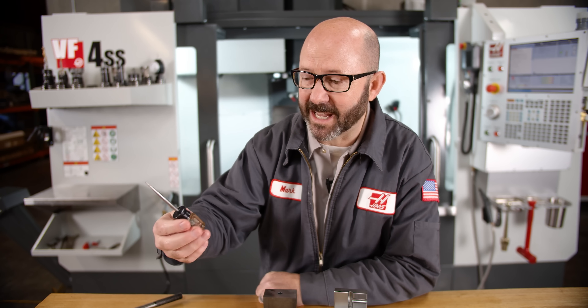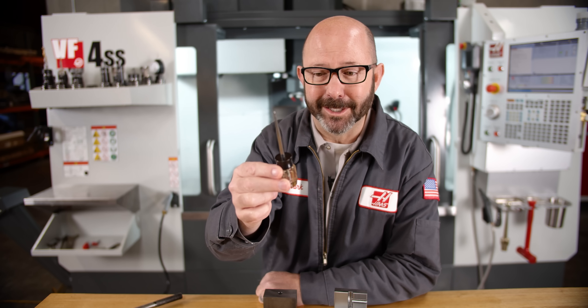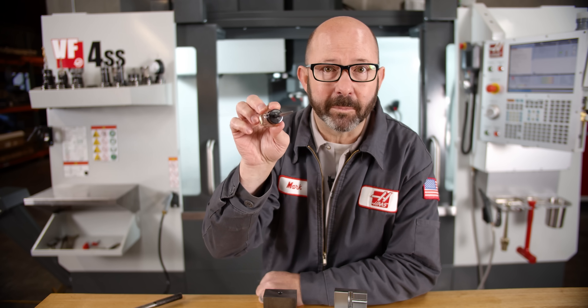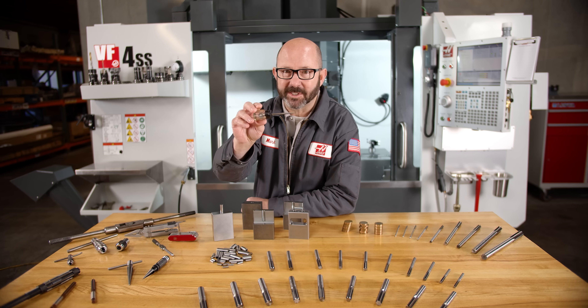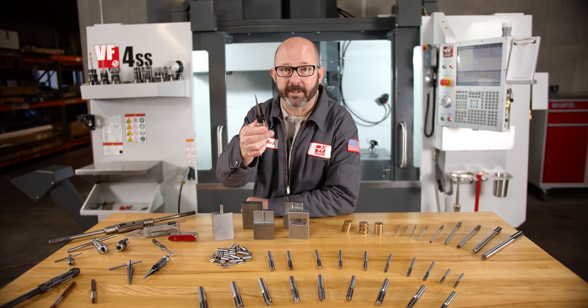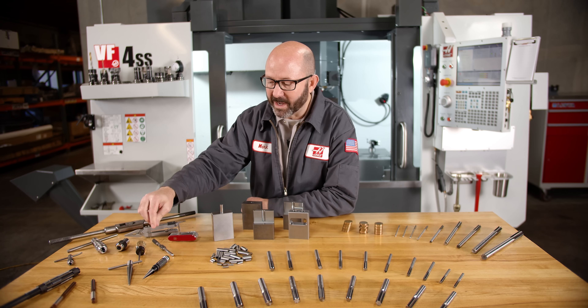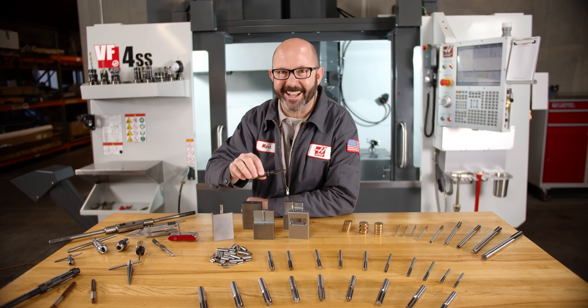If you're still here, I just wanted to show you one tool on the table that did not belong. This is not a reamer — this is an awl, and some people confuse them. Awls are meant for punching holes in things: leather, plastic, what have you. This is a scratch awl, meant for marking our materials. Reamers are meant for making existing holes larger.